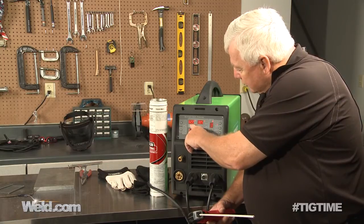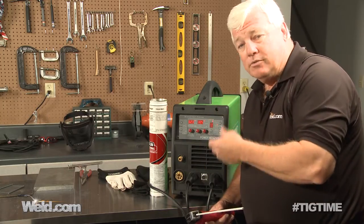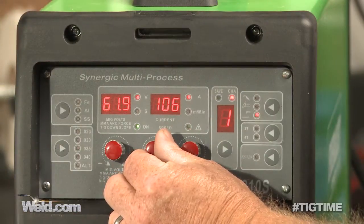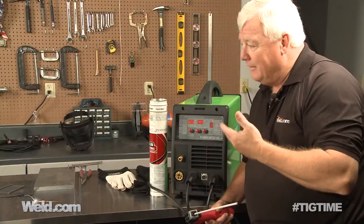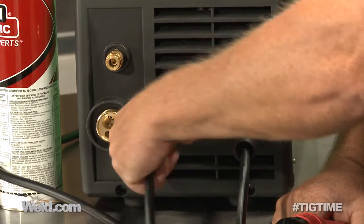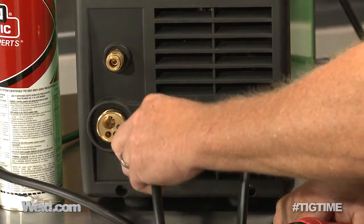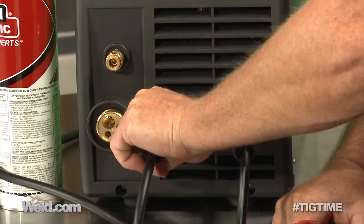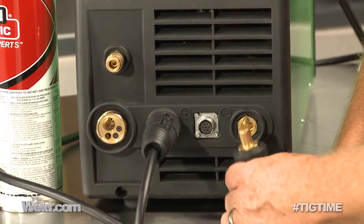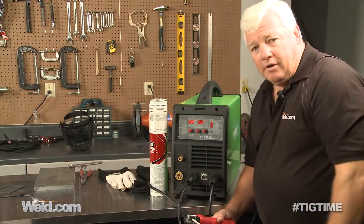This function here is the open circuit voltage that's already preset on the machine. The variability is going to be amperage. I've already practiced just a little bit with a couple of samples and I've found that 105 amps is the one I want to use. I'm going to do a fillet weld — typically the tougher of the welds. The stick electrode holder goes into the DC positive port. This right here is the ground, and it goes into the DC negative port. So let me put my gear on and we'll see how it welds.